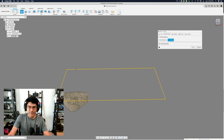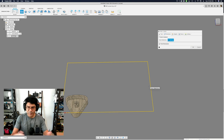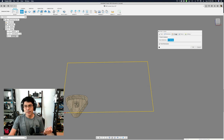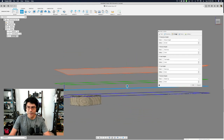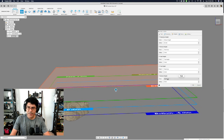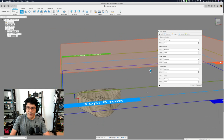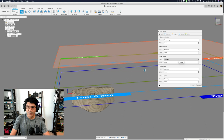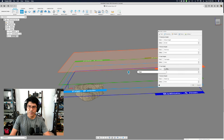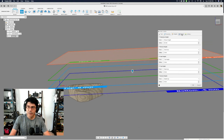Under the geometry tab, the yellow outline gives a visual indicator of what the facing operation covers — really the whole piece of stock. We want to slim down the entire piece to our desired keycap thickness of 7 millimeters. Under heights, it's already set up: the bottom height stops at the top of our model, so the cut stops right before getting down there. The top of the cut is the stock top height, which we defined as 12 millimeters. Then it stops right before reaching the model.